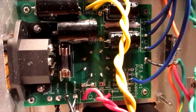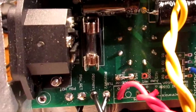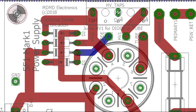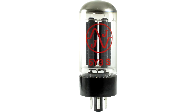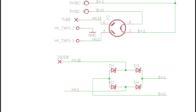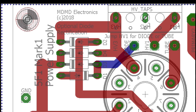Now let's take a close look at the power supply board. We start with the standard IEC connector so that our amplifier doesn't have several feet of power cord sticking out. Next we have a convenient cartridge fuse holder. There are also convenient solder points for power switch leads as well as the power transformer input and output connections. The 5Y3, true to its description, is literally a current rectifier used to create DC voltage from the power transformer's high voltage AC output. Modern silicon diodes can also be used for this purpose and have less voltage drop.